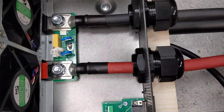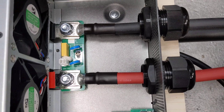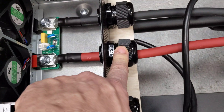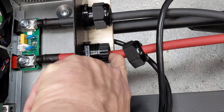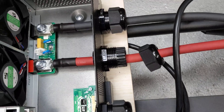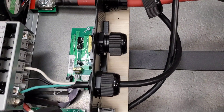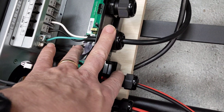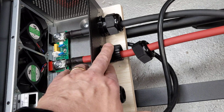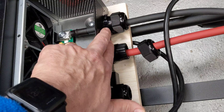Other things to know and watch out for: don't really reef on those terminals because they're just not that strong. This comes with rubber grommets, which I think is pretty useful — they're usually a buck or two each. It closes up with a little rubber grommet inside and makes it somewhat watertight, though they don't have to go crazy since there's plenty of venting anyway. They come in small, medium, and large. The small ones went with the PV connections, the mediums were for the 110V in and out, and the large ones were for the battery cables.